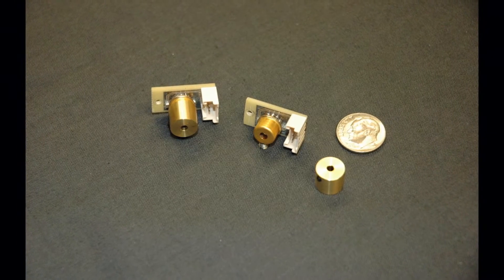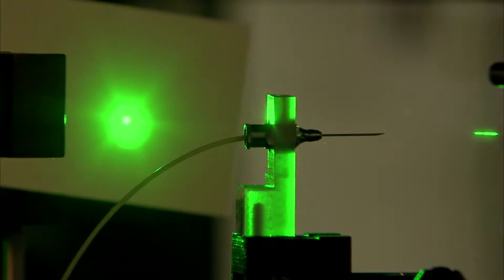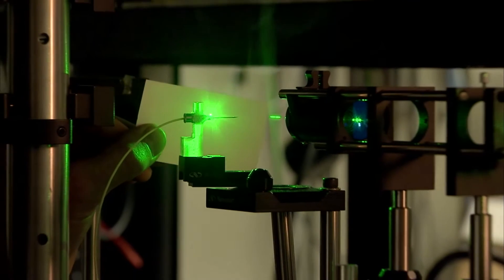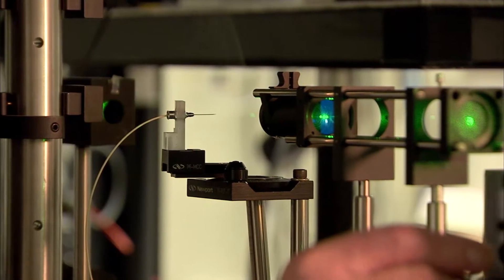The MPASS is actually an optical sensor. We determine particle properties by looking at the way they scatter light. It is a small scattering sensor that contains a laser source, very similar to the technology you would have in your CD or DVD player. Then there's an array of detectors that measure that scattered light, and from that information we can determine characteristics of the particle properties themselves.